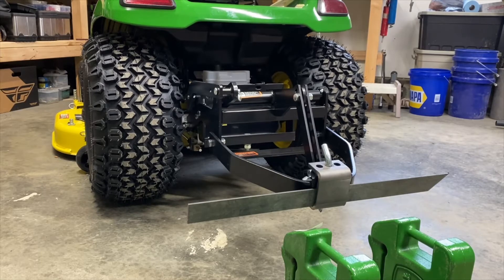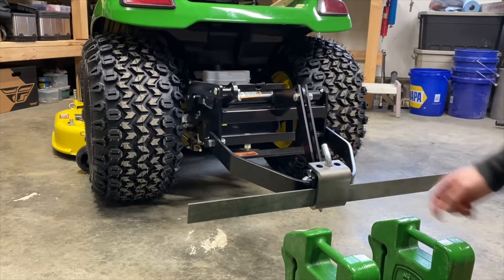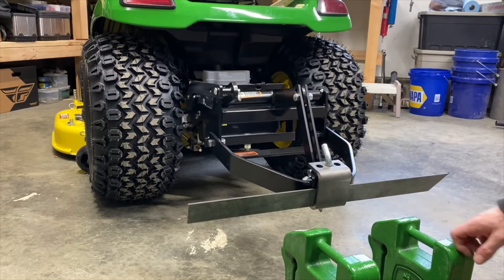What I'm going to do here is test how much this hitch can actually lift. I took a piece of steel I had laying around and put it on the back of the sleeve hitch. This piece is what I'll use to build the new sleeve hitch implement on. I basically sandwiched it between the bolts on the back and tightened them, so it's locked in there pretty good, and I can hang the John Deere quick-tatch weights on it. Each of these weights is between 40 and 42 pounds — we'll call it an even 40 for round numbers.